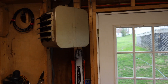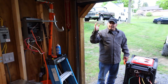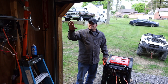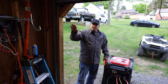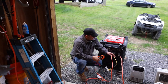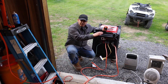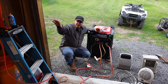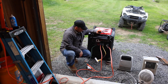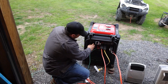It's basically locked to the setting right now, so we're not going to change any settings. Just know that's off our 220 side. We're going to do some amp tests on this, but first let's get some ratings on what these heaters pull. With those two heaters going and the heater in the shed, we should be pulling around 7,700 watts — and then we'll put it over the top with the other heater. Let's get her fired up.